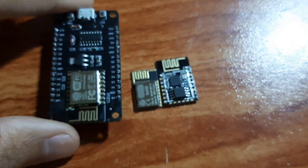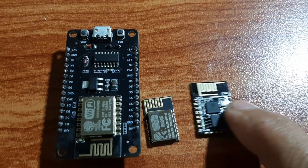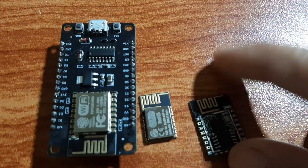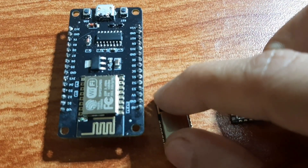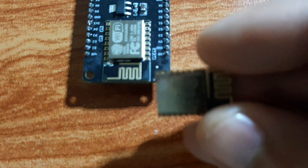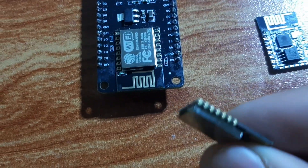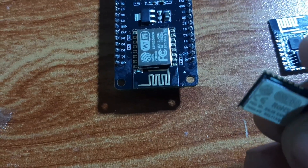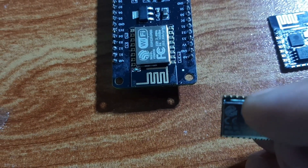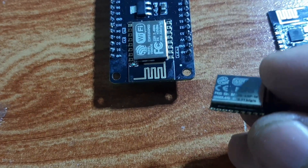For comparison, this is the NodeMCU board, next to it is ESP8285, and this one is ESP8266. On this board I've removed the outer shell of the chip, and I'm also going to remove the outer shell of this chip so you can see the IC. You can remove it easily by inserting a flat screwdriver on the corner and pulling it out, or by using a soldering iron on the sides so the protective cover comes off.